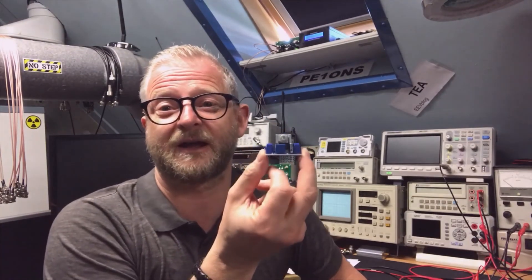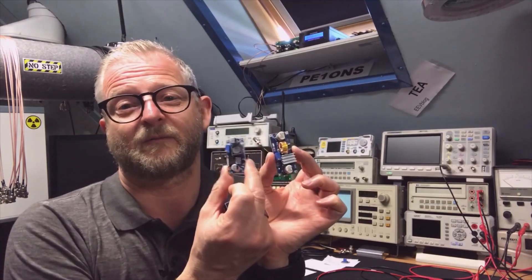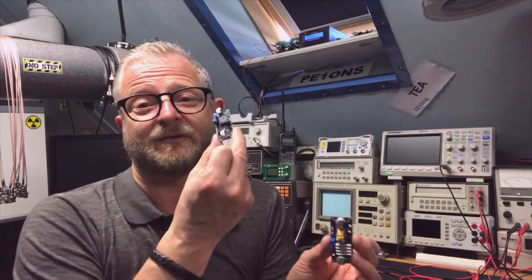So to summarize: if you want a clean signal, go for the LM317. If you need more amps, the LM2596 does 3 amps and the XL4015 does 5 amps — both are a little less clean but handle higher currents. I would absolutely go for the 5-amp model. Thanks for watching and I hope to see you next time.